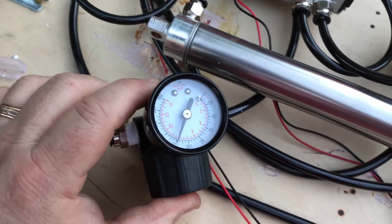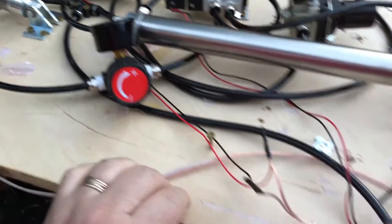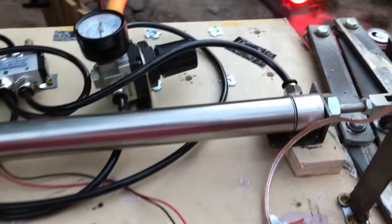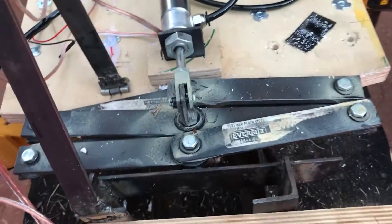This is a one-and-one-sixteenths bore air cylinder that pulls the head up so the head rears up as it's attacking. There's a regulator on here — it's set at 120 psi, which is pretty close to the max this needs. Then there's a second cylinder: a 10-inch, also one-and-one-sixteenths bore, and it pushes on this scissor.